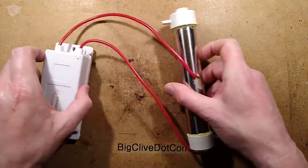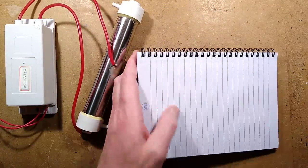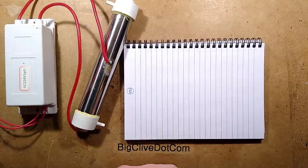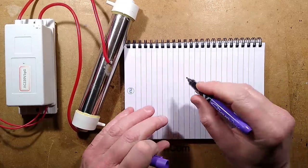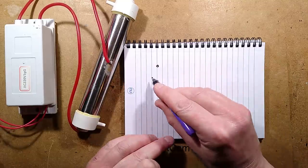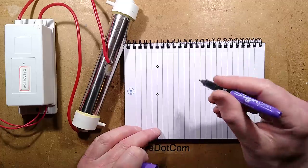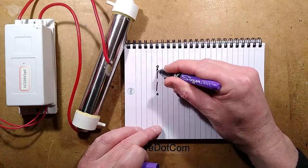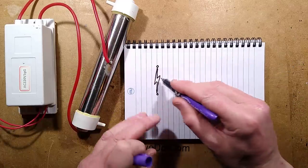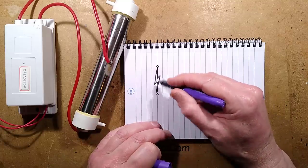Let's talk about the process of creating ozone. The principle of ozone is this: if you have two electrodes — particularly the corona discharge method — and you pass a high voltage between them, a spark will jump between them and it'll make a loud fizzing, cracking, popping noise. As air flows through that, it will get exposed to some of that arc, but it's very inefficient — it'll be giving off lots of heat and burning up the electrodes quickly.